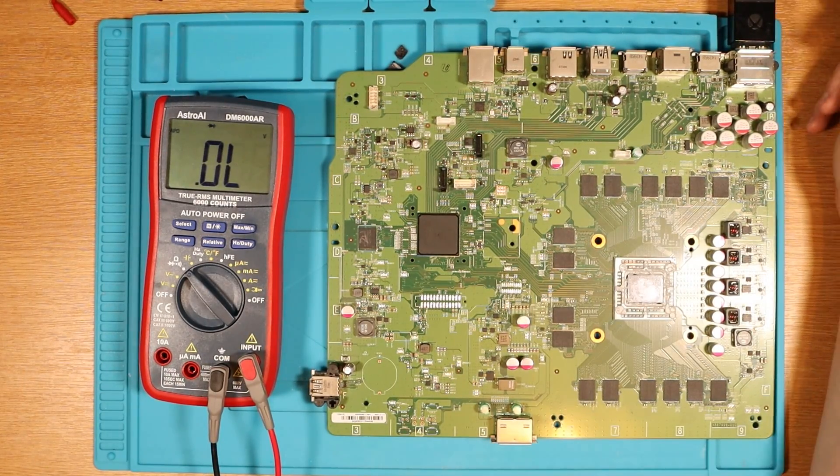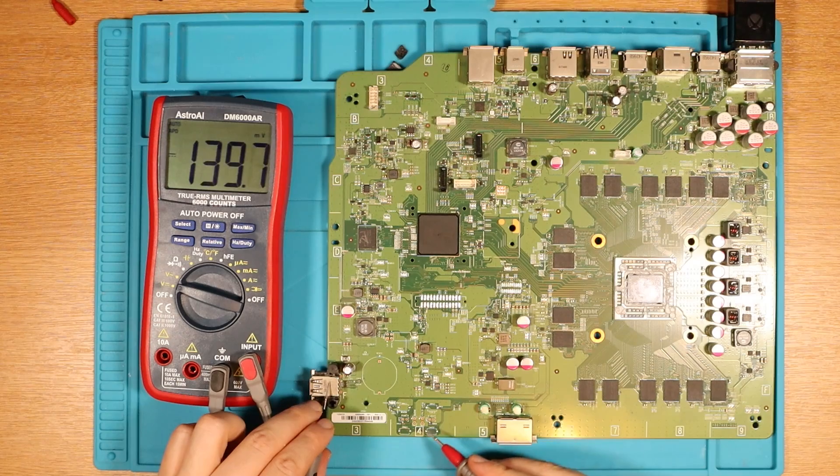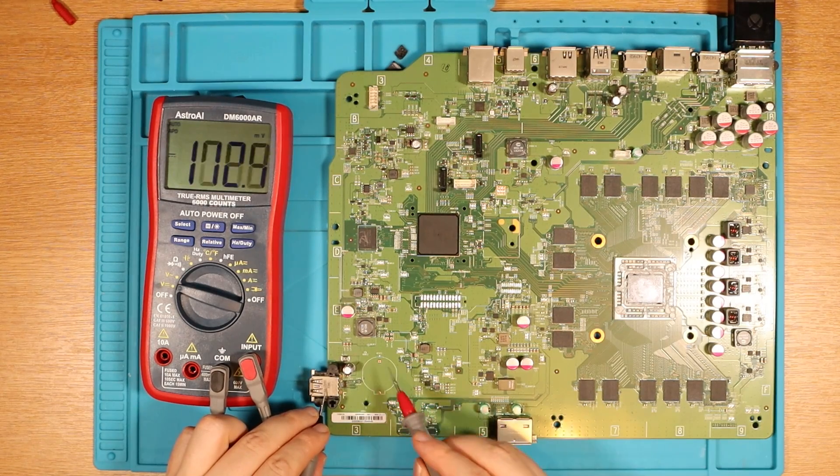I've now just plugged the Xbox power in and I'm going to check the standby voltages on the Xbox One. So we go to voltage mode — black probe on ground. Around here is the 3.3 volt power line. On the eject I should be getting 3.3 volts but I'm not getting that. Moving over to what's noted as 'cold' — that should be 3.3 volts, and then 'power' should also have 3.3 volts, but we get 93 millivolts, which isn't what it should be. So we're not getting the right amount of power to 'power' and we're not getting the right amount to the eject button either — that's 79 millivolts. There are two more test points: CLK and data — data comes out at 3.3 exactly and CLK comes out at 3.3 exactly as well.